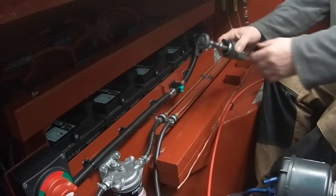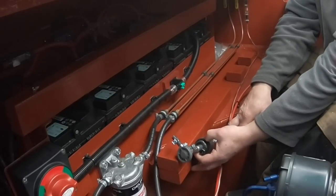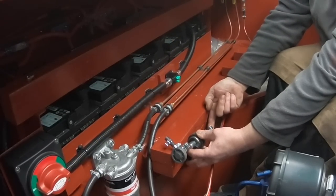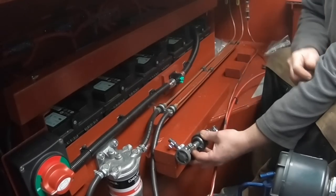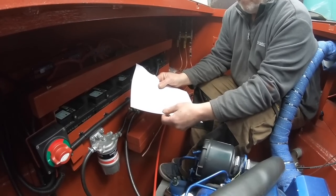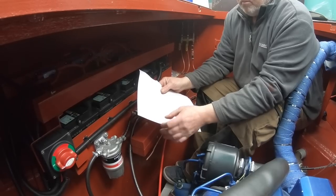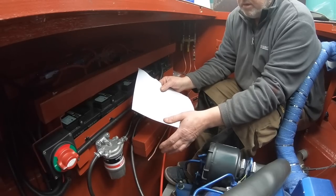across here, and we're just deciding on the position of the fuel pump at the moment because it's got to fit on here, but it's also got to be at a certain angle for it to work correctly. So that's going to just run down and then drop in, go onto that connection just there. And then obviously out goes off to the heater. Oh yeah. Right, what angle is it that they say it's got to be at? Between 15 and 35, I think it is, 33, somewhere in that region. So we've worked on the middle, there's about 22 and a half degrees.